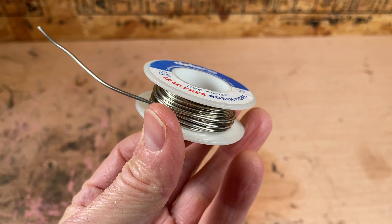Hopefully I was able to make a good point about heat. There are obviously many intricacies with soldering — many different methods, many different types of soldering irons, tips, sizes and types of solder, some containing lead and some not. But really, I'm just trying to make a point about heat: in order to get a proper soldering joint, you need to apply even heat to the joint itself. The solder should then be touched to the joint and flow into it — if it's just being dripped on, it's not going to work. If you think I did a good enough job, please hit that thumbs up. Consider subscribing. I'm Jimmy for One Road, and I will see you in the next one.